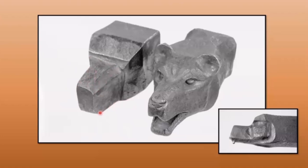So once I go from the octagon and start to make this round, you'll notice I'm going to hold this flat on the anvil and I'm going to change the angle of my hammer as I start to knock in those lines. I need those 45s on the bottom. And if you look at this bottom right photograph, I want to be able to get my fuller in there. And if it's round on the bottom there, my fuller just runs the risk anyway of skipping off.